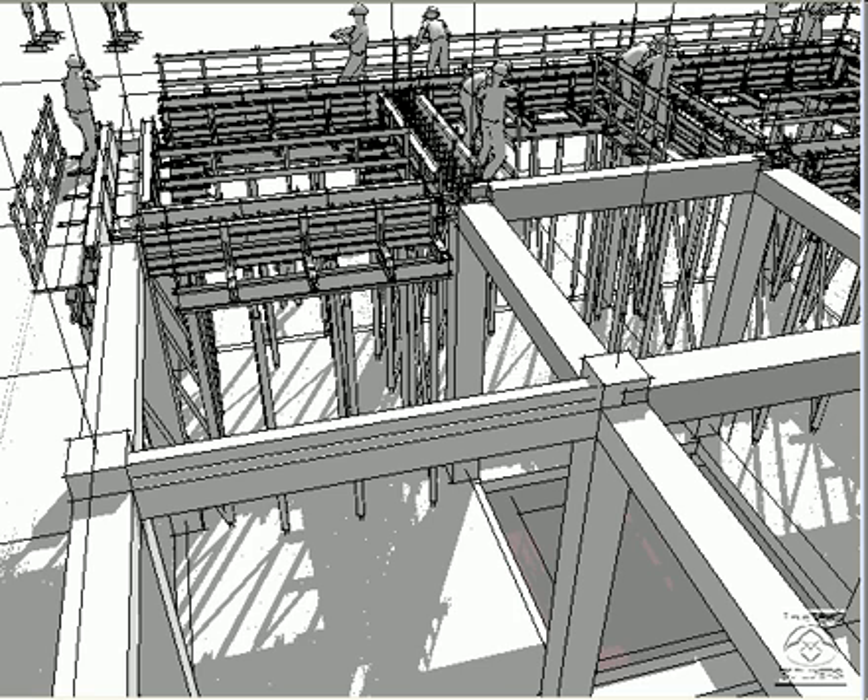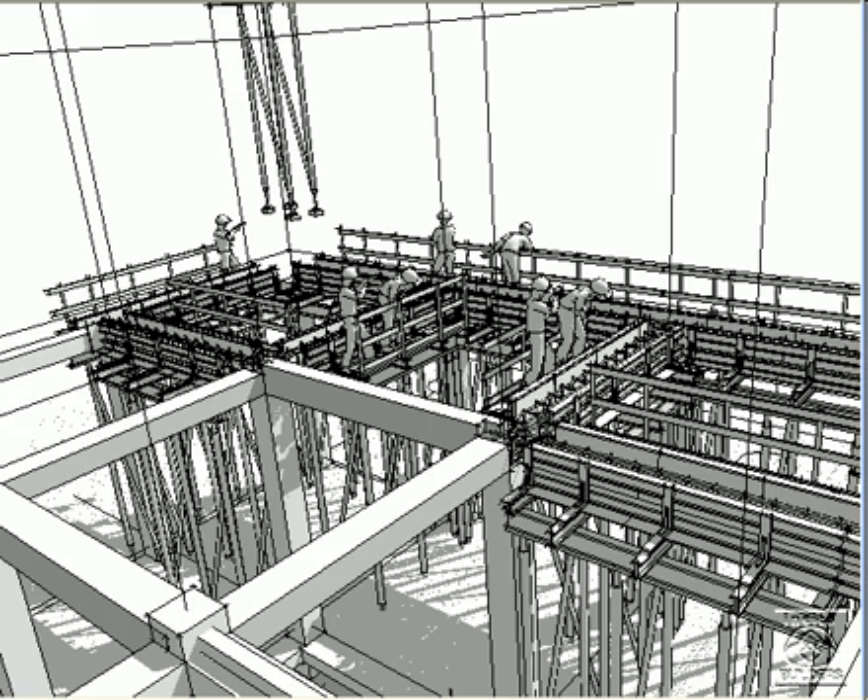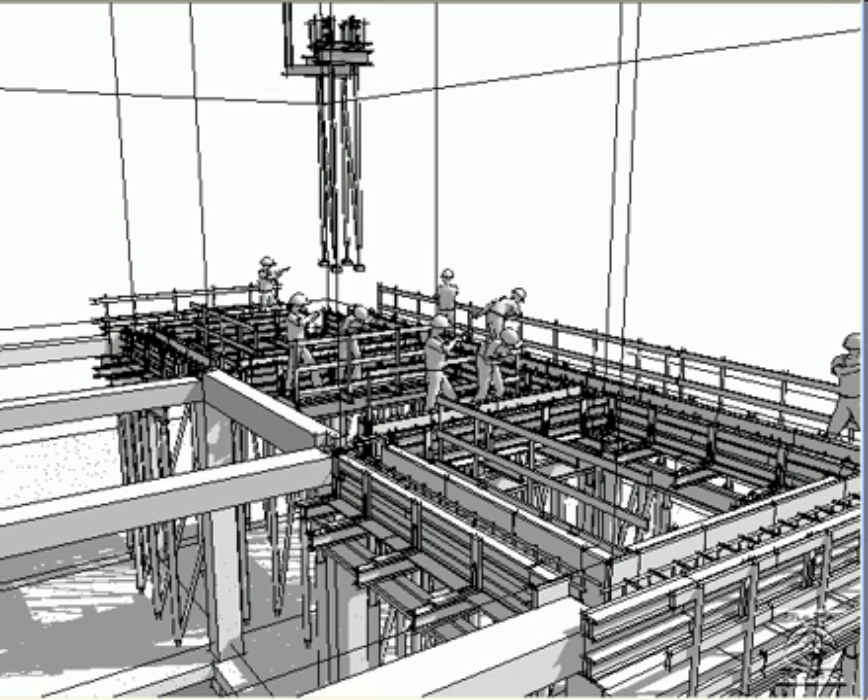What may look like chaos then is really a coordinated effort — an effort that means understanding the time sequence of the formwork and rebar placing, the concrete pour, stripping, and then curing the concrete. The goal of a field manager is to complete the sequence as quickly and efficiently as possible, which means understanding field crews, labor time, material delivery, and the technology of concrete itself.